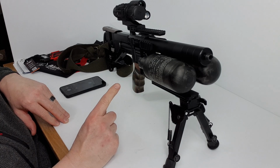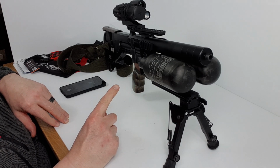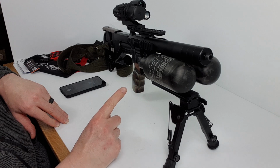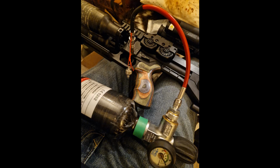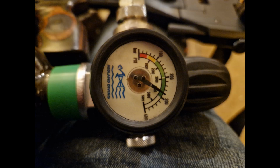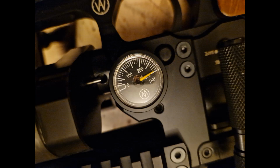What I'm going to do now is proof of the pudding. I'll go and fill it up and check there's no leaks. I added a touch of silicone grease to the O-ring beneath this grub screw, slowly topped up the rifle through a succession of stages up to nearly 300 bar. And it held this 290 bar that you can see here. It held that for a week perfectly.